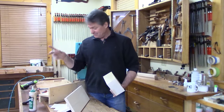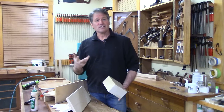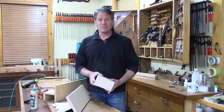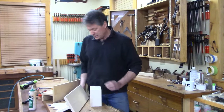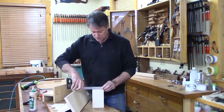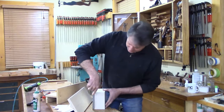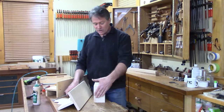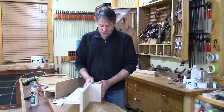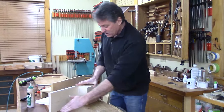That one, I've got it still over there, is cedar, so it was really light. I just happen to have a chunk of that around. The one I'm using measures 3 5/8 wide, and the height is 6 1/4. And this is really just a nice backer for when it's attached to the jig. You want a good solid backer that's 90 degrees to the table.